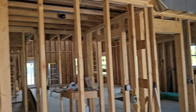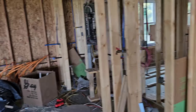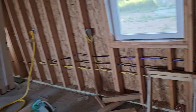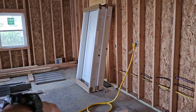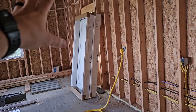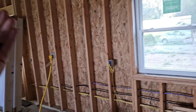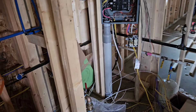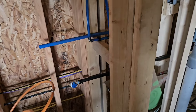So now inside the house: we got all the fire blocking in. I had to do that all the way around the house, wherever there was a continuous stud cavity all the way up. All of our wiring's done. I was just running Ethernet cable for a security camera — putting cameras basically anywhere, in locations that will allow me to see down every side of the house. Figured, why not do it now instead of having Wi-Fi cameras?